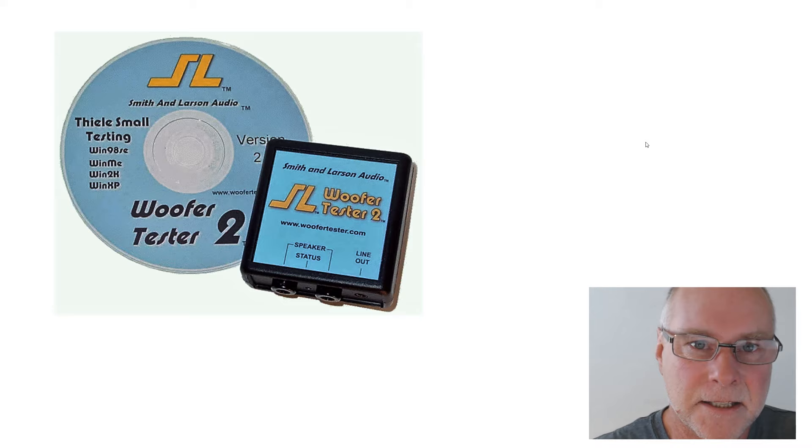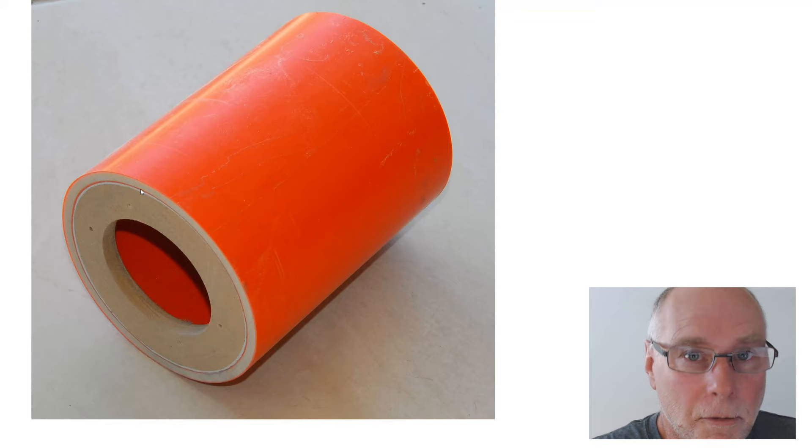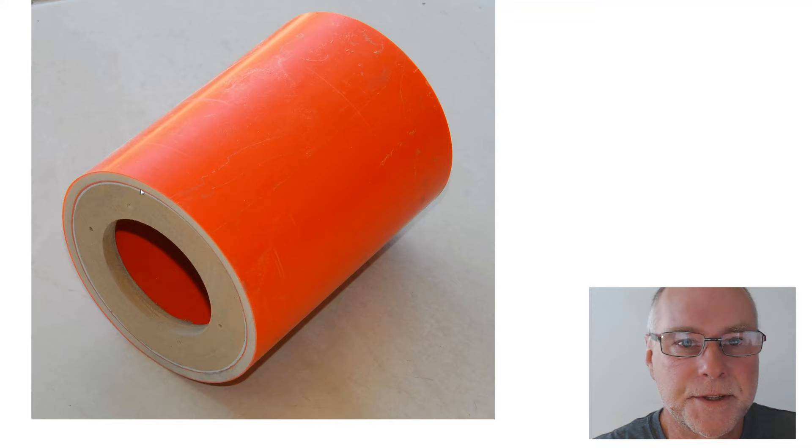So what does the speaker enclosure look like? The key thing to look at in this image is the thickness of the pipe — the wall thickness of the pipe. Don't use thin-walled U-PVC pipe, the sort that's used for drain pipes and things like that. See if you can find a place where a factory's being built or an industrial site, and you'll often see offcuts of this really heavy-walled plastic pipe. I'd say that wall thickness is something like five millimeters.